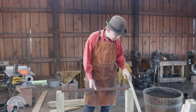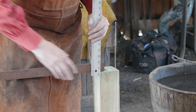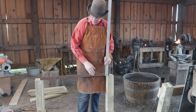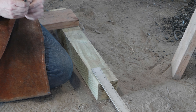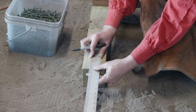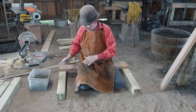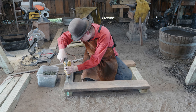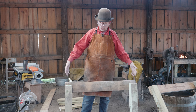The one I'm making — I forgot to measure long enough for an overlap here, so I'm going to have a little notch on each corner. It's probably nicer if you do measure those front boards a little bit long so that you don't have a gap right there. Once we've got the two long bottoms on, we're going to start screwing on the tops. What we want to do is make sure that the tops come level with the top of our angle iron.